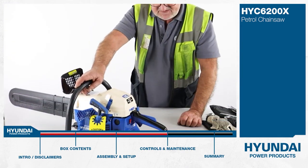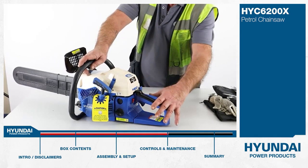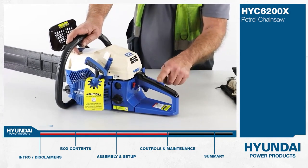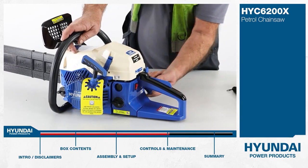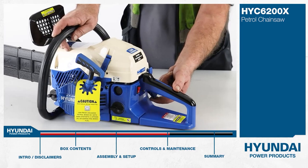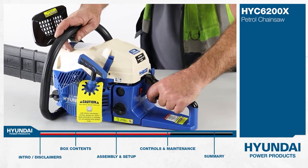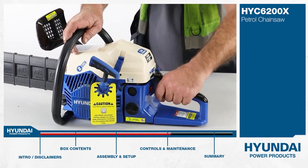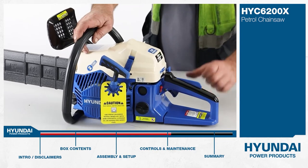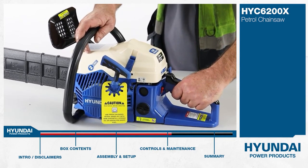So let's go through some of the controls. This end of the unit has basically most of the controls, okay? So we have the throttle. Now, the throttle is under here, and as you can see, I can't push it up unless I push this top lever down. So during use, obviously your palm would be on that, and you can pull the throttle. And that is the accelerator for the engine. So when you let go, the engine would run at idle speed, and obviously when you pull the throttle for cutting, the engine will rev up to maximum speed.